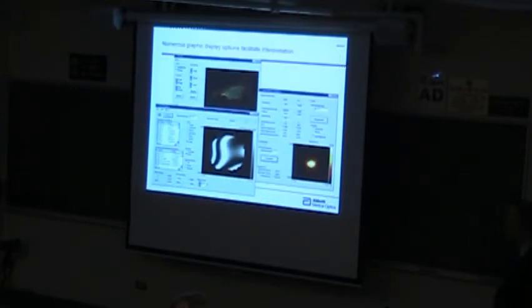So I don't know, this is just a couple of things. I mean, here's a laser beam analysis where we're calculating things like M squared, waist size, waist position, overall beam quality. If you're used to interferometry, I can calculate fringes from the wavefront. It's kind of the other way around from it.